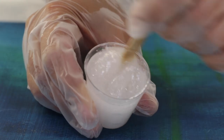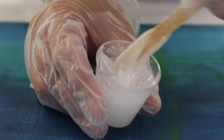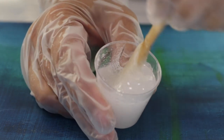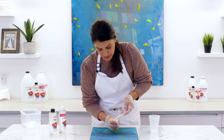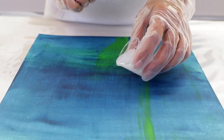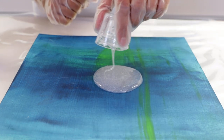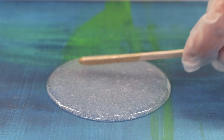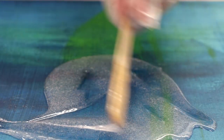Those bubbles you will never be able to torch out. Normally when you first mix the resin and hardener it's a little cloudy at first, but then it becomes translucent as the two parts mix together — but this is like an entirely different thing. As I pour you can see all of those bubbles — that's not from mixing, that is because the resin is cold. I'm just going to spread it out a bit, and you can see these frothy areas that are just full of bubbles.